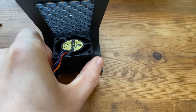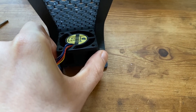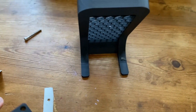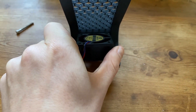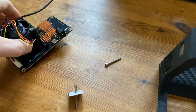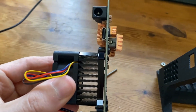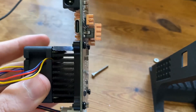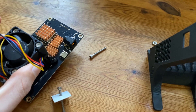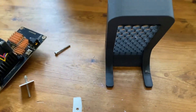We also have the option to angle it to hit the heat sink and the ASIC chip at the same time, but we'll look into that after setup and see if we can make an angle so air flows all the way up through the honeycomb. First we'll cut this out, find the placement, run it, benchmark it, and then think about angling it.